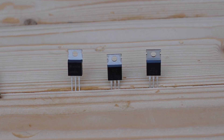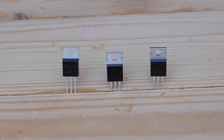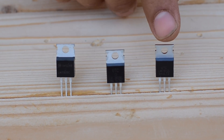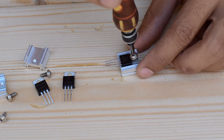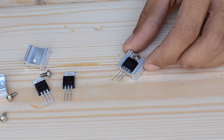To regulate the output voltage we are going to use linear voltage regulators — LM 7805, 7809, and 7812. The last two digits represent the output voltage. Since excess energy is converted into heat energy, we are going to put aluminium heat sinks along with each regulator.